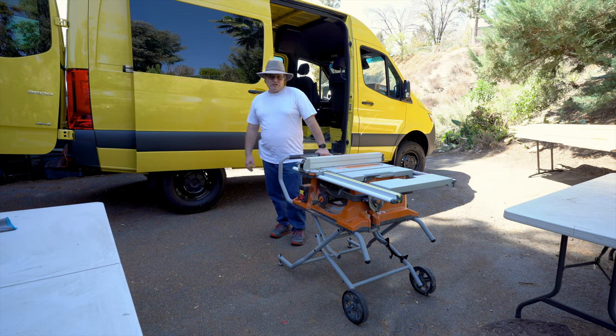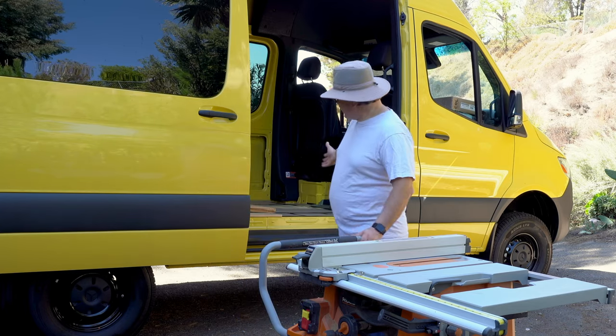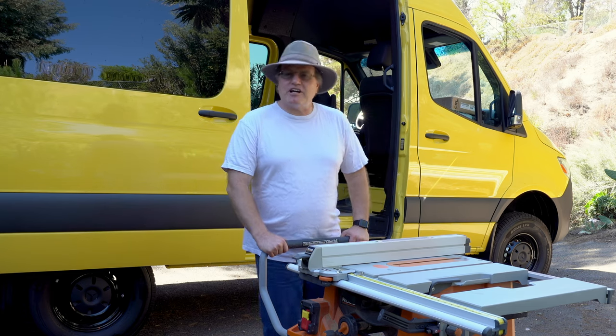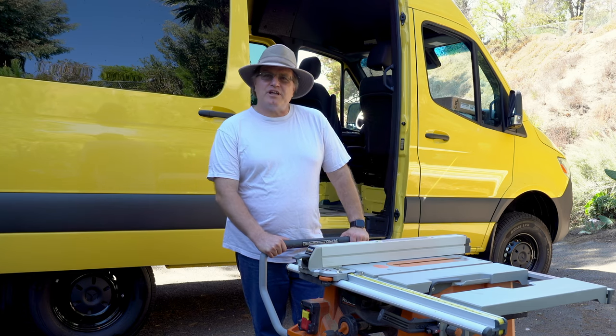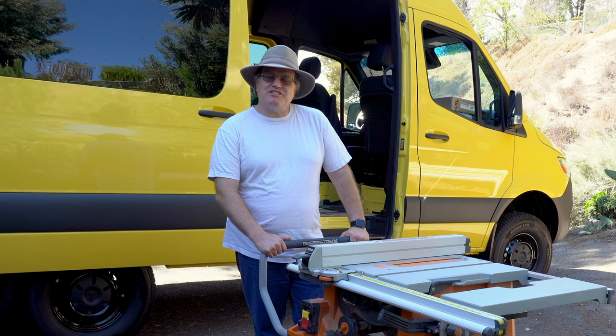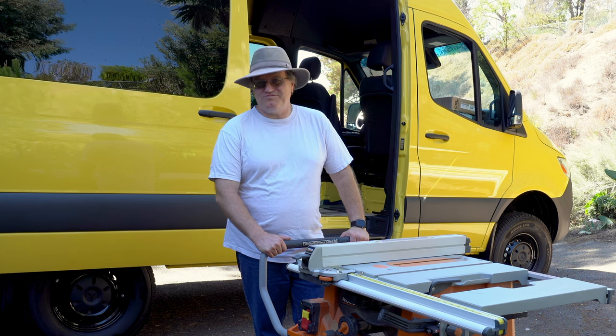We're almost done with the floor. Today we want to finish it over here. Just have one more element to cut, and then I can lay down the floor. I will cut the furring strips and glue them down, and then I have to wait and start to insulate with sheep wool.